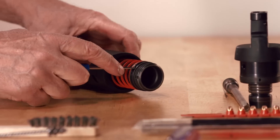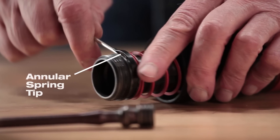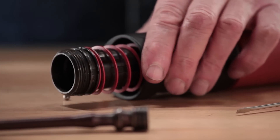To remove the annular spring, insert a flat blade screwdriver under the tip of the annular spring and push the spring up and off the piston guide sleeve. Take precautions to keep the spring clip from flying off the tool.